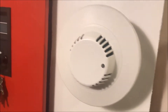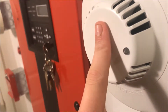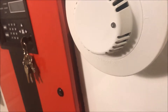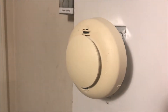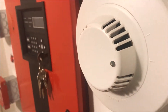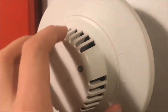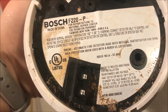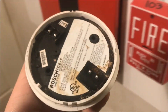I won't be testing the heat detection feature because I cannot get it to work on this particular head. I sat there with a hairdryer on high for like five minutes and it just wouldn't do anything, compared to another unit where it takes about a minute to a minute and a half. The base does say 'automatic fire detector head with integral heat detector for open area protection' and it's rated at 135 degrees, but I cannot get it to work.